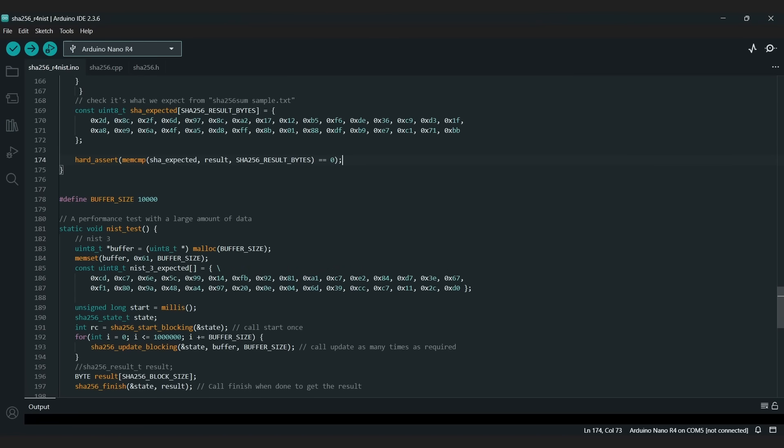To do the testing, we're going to be using Arduino. About the only system you can use to program the CH32 board is Arduino — it doesn't support much else. So I'm using Arduino for everything, even though underneath there are different toolchains and different compilers: RISC-V compilers versus ARM compilers, third-party compilers versus the standard ones. But it's all Arduino using the same code — that's basically the idea, as close as I can get it.